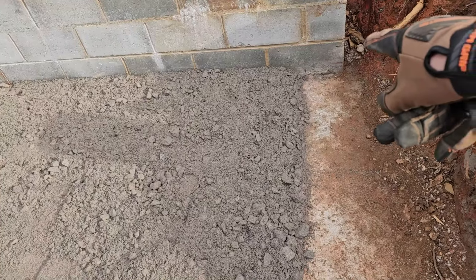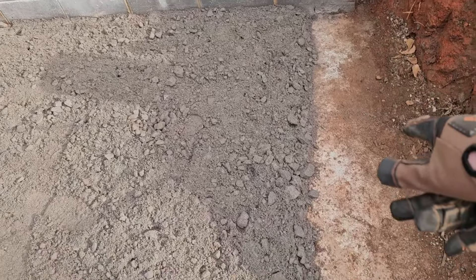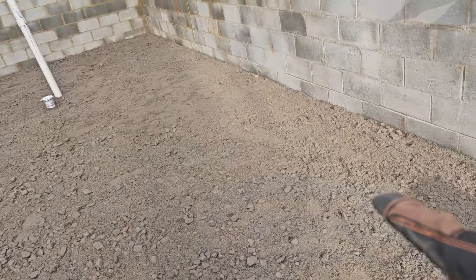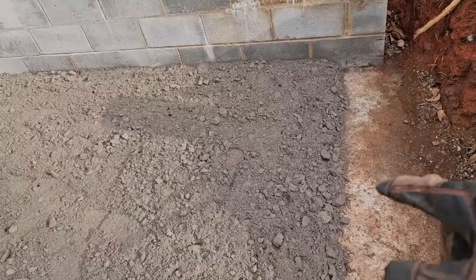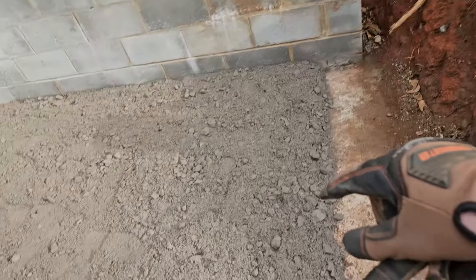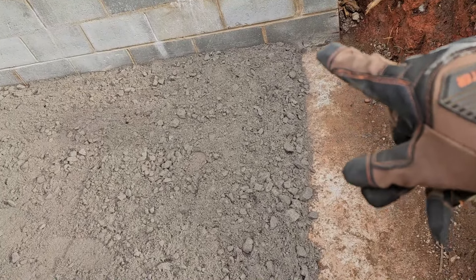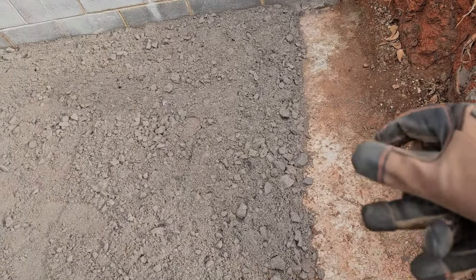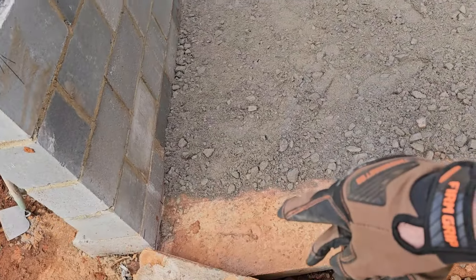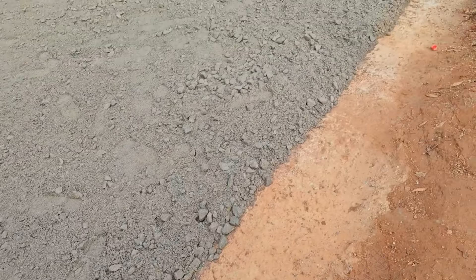We set eight inches back. That is so that as the slab — which only needs to be four inches for this, four inches is plenty — as that slab comes across here on the gravel, it's nice and firm. But then where the actual end gable wall will be, that wall will be able to have the concrete set directly onto the footer. So there will be no squishy gravel — yes, gravel doesn't squish too much, but it does squish a little bit. It doesn't let you create a good mechanical connection. So that slab will come down and just be able to set directly onto the actual footer here.